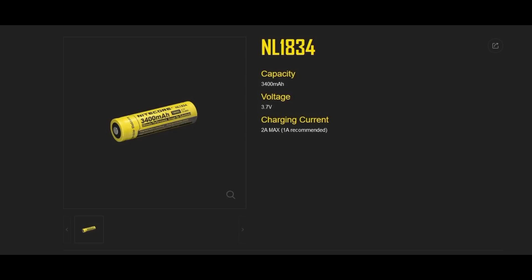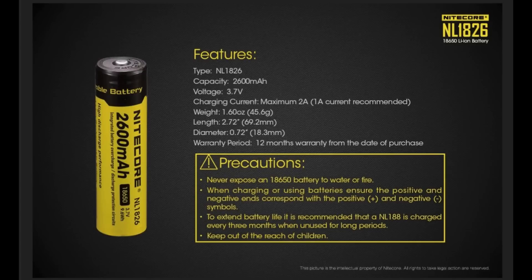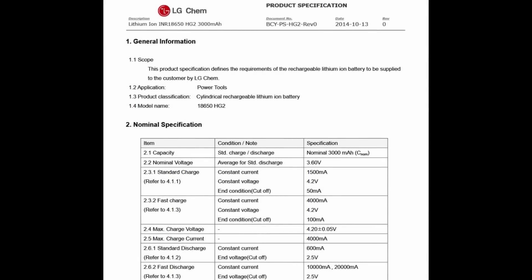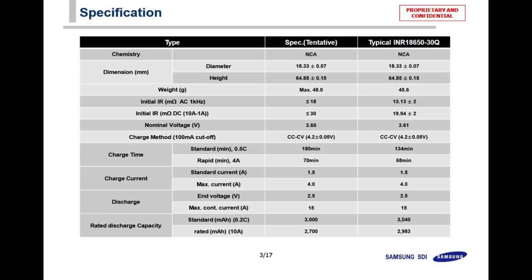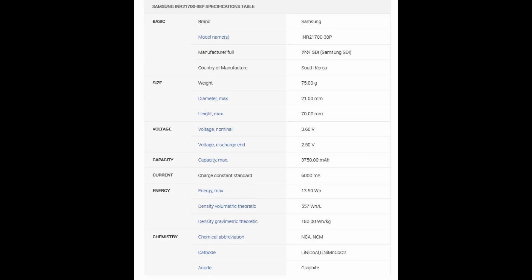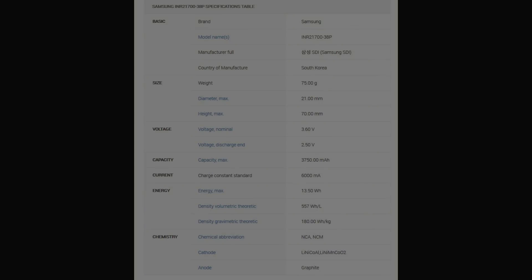I've got a couple of batteries on screen here. They're recommending a charging speed of 1 amp with a maximum of 2 amps — so it's not unsafe to use 2 amp charging for a single battery. Some batteries will accept a much larger charge; this particular LG one can charge up to a whopping 4 amps, but that will degrade battery life. The rule of thumb is: high drain cells will take a faster charge, whereas protected cells I'd normally charge at around 1 amp. You can charge at 2 amps but you'll shorten the cycle life.